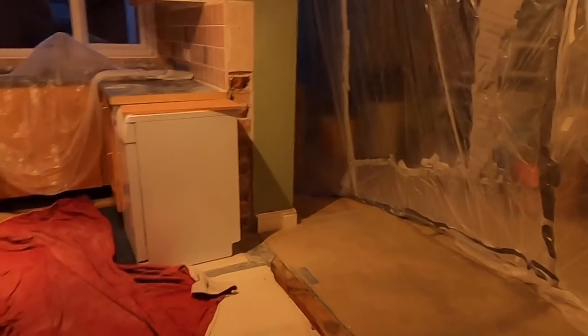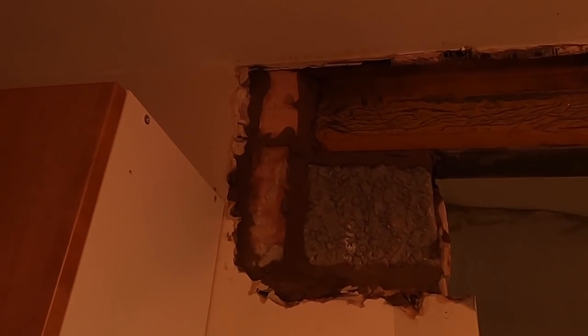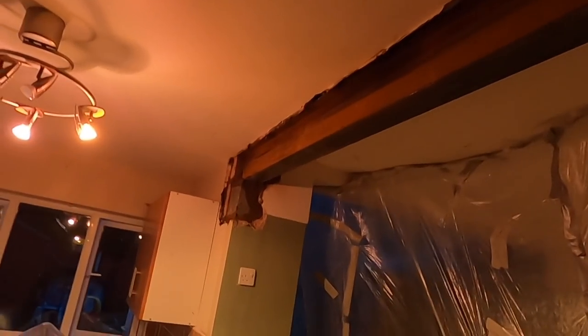There we have it. Sealed up. And then that's with the 2 course, 2 brick pillar gone. But like I said in the video, it's brick on brick here, so that's all been rebuilt and toothed in. Give it some strength. And then built up right round the top there. Good 200 seat in either end. Probably nearer 220.